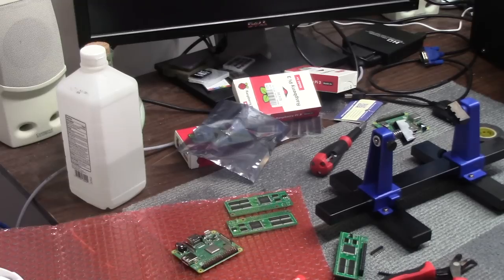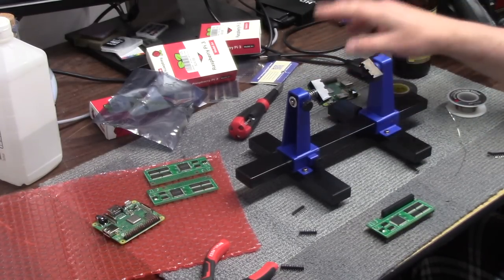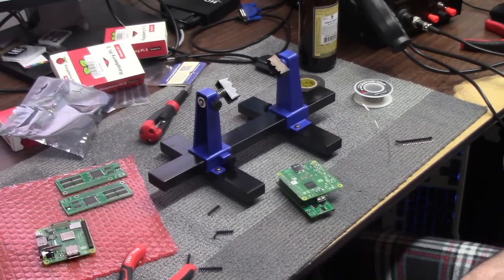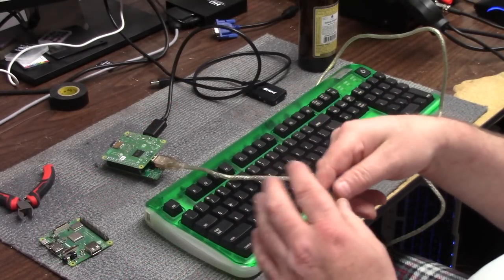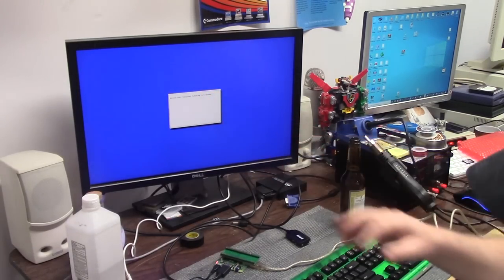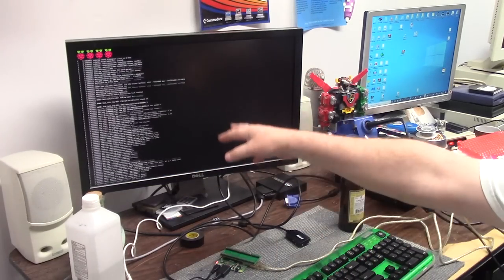I just knocked over all my screws. Don't be like me, but I'm impatient, and now we take our Raspberry Pi 3, and I'm going to hook this sucker up because we've got to do some Raspberry Pi stuff. And so here's our assembled PiStorm. Let's just clean up all five. So I have power via the USB. Pi's booting. It'll load Linux because remember, this is a blank build, so it's automatically Raspberry Pi OS, which is Debian, same thing I use for PiMiga.